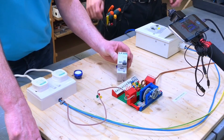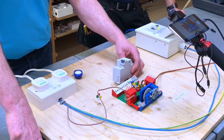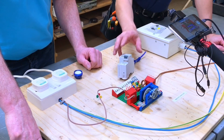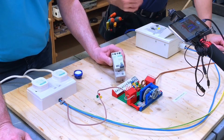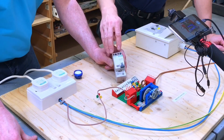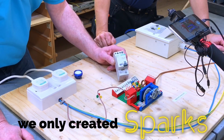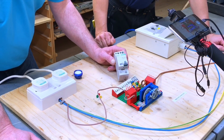It's in its infancy. Let's not throw it under the bus - this is an emerging technology. It's not currently a requirement of the regulations. I'd like to think by the time they may introduce it as a requirement, the actual technology will have caught up with the idea. This is a two-module unit - you have an RCBO paired up with the AFDD unit. But I understand that this year they're going to be coming out with a unit the RCBO size that contains the technology, making it easier to retrofit into existing consumer units. As it stands, apart from these Starbreaker devices, it's very difficult to retrofit because you've got to modify the bus bar. So in summary: emerging technology, we've got to create a certain type of arc, which we never managed to do with this fantastic piece of equipment with a 4kW load.